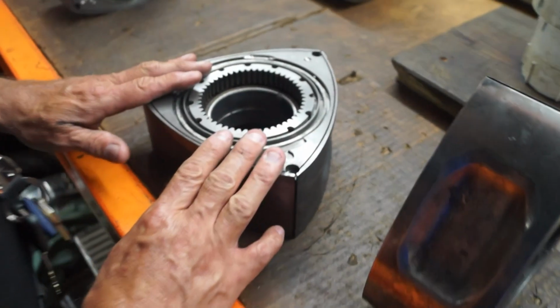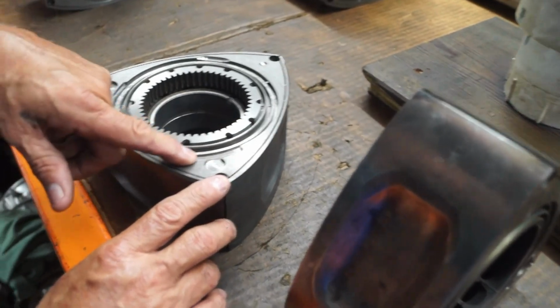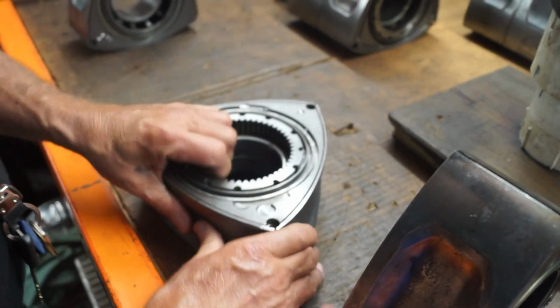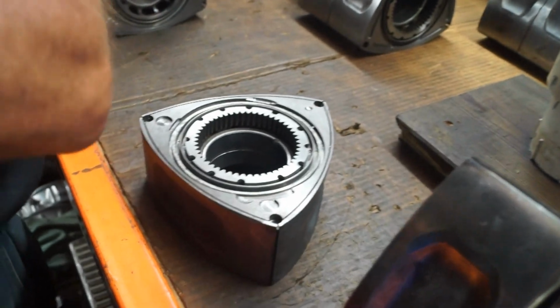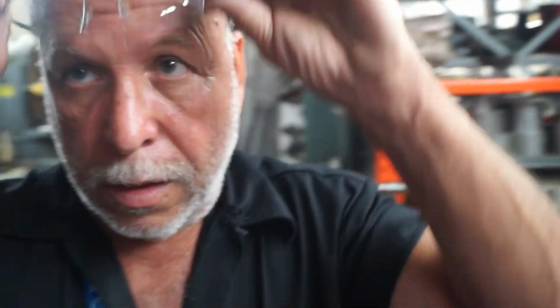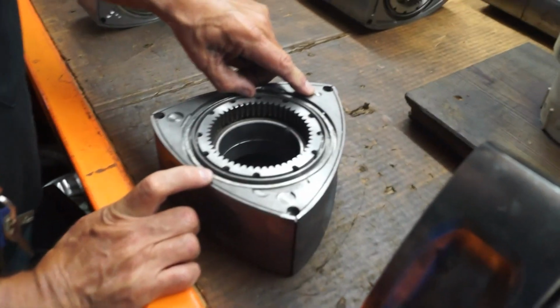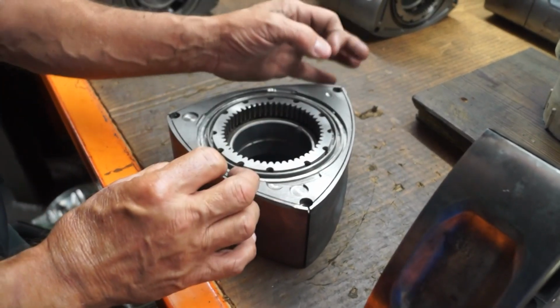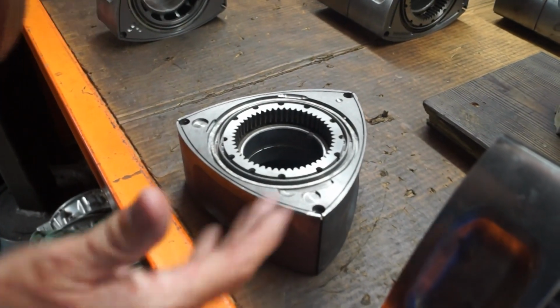So anyway, spinning it, correcting, I overcorrected. Oh, shit. It's simply because to make these types of operations, you have to physically remove it from the mandrel, from the balancer, take it to the mill, make your correction, hope that you didn't go too far, come back again, and do it again. Because you weren't able to use that grinder tool? Correct. The grinder tool is that spot right there. That's when I'm already so close that all I have to do is remove tenths of grams to get it where I want.